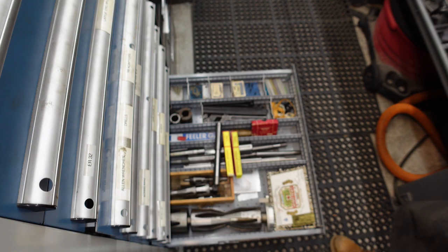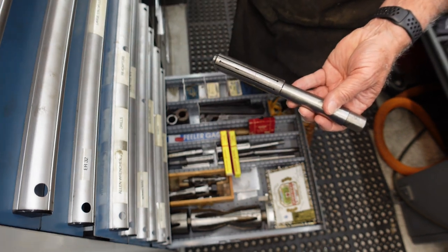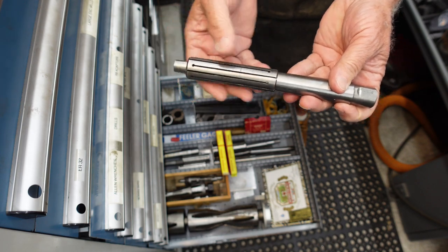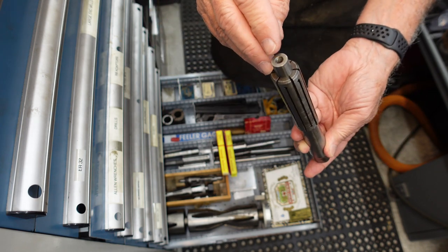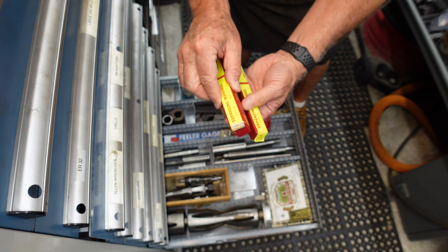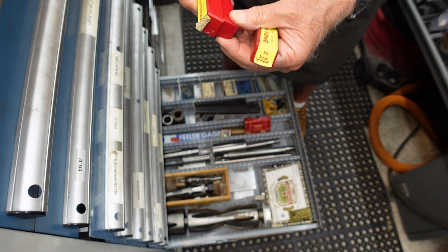Here's the drawer that has mandrels in it. There are these types of mandrels that are tapered — it spreads this collar open so that you can fit a variety of different diameters. They're center-drilled so you can run them between centers. I've got a full selection all the way down to small ones — this one's for half inch to eleven-sixteenths, and three-eighths to half inch.